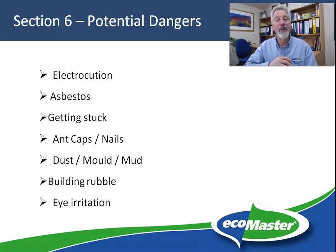If you have asbestos and want to remove it, have it removed professionally. If you still want to insulate your underfloor, consider wetting down the area with a hose and sprinkler in order to damp down any dust. If the fibers are held in wet soil, you're less likely to breathe them.